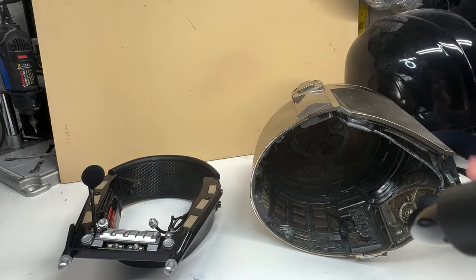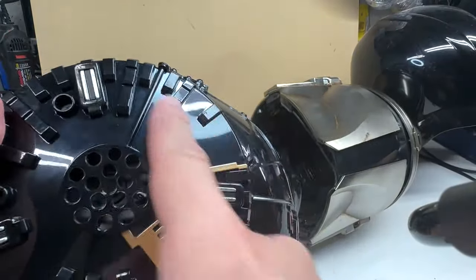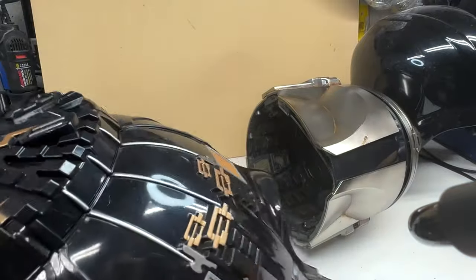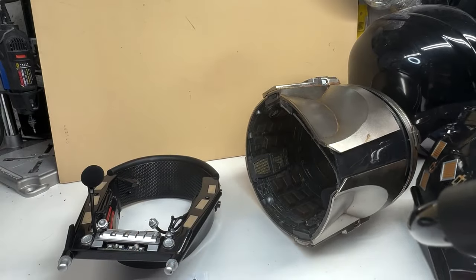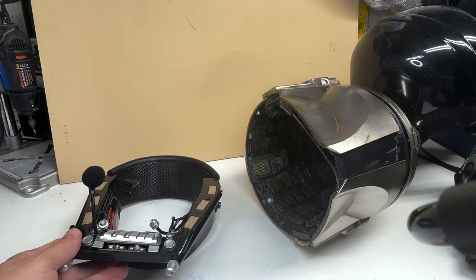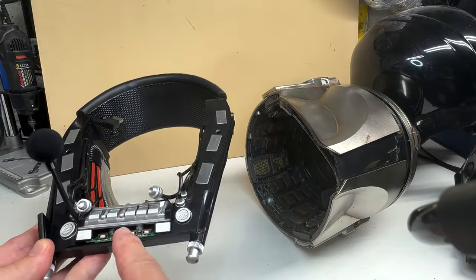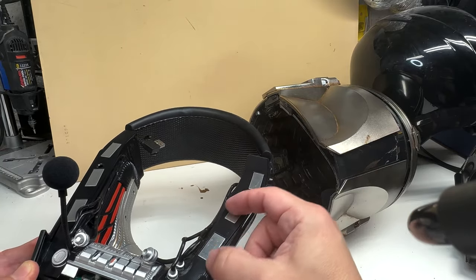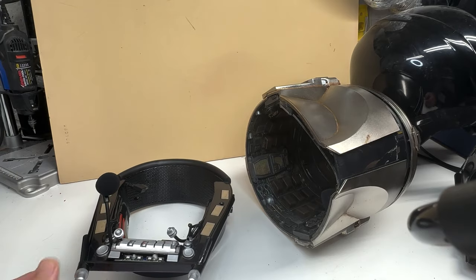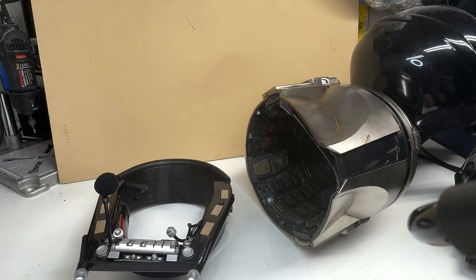For the future Vader build, I'm going directly to a second speaker and not messing with the original speaker. Speaker-wise, fit whatever speaker you can. In this Vader one I was able to fit a larger speaker in the top dome — it had a lot of good room in there. I recycled a larger speaker into that area and it echoes down through the dome and works really well. The cool thing is I was able to make it wireless by running the wires from my amp through the magnets — positive through one, negative through the other — up into the top of the helmet to push to that speaker. As soon as you place the top of the helmet on, it starts pushing out that speaker.